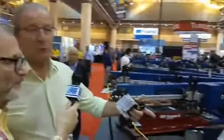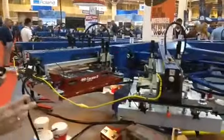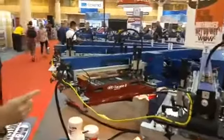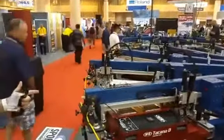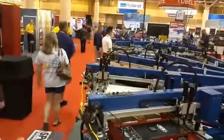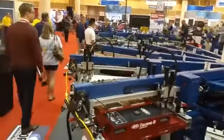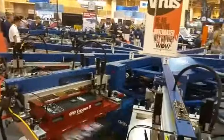Okay. Hello to everybody, first of all. As you can see here, we are printing wet-on-wet. First, we print a white underbase. Usually we use two different white underbases, one in 305 mesh, and the second one 150. The reason is to offer the white underbase two levels in order to have shade and light at the same time. So we can move over there.